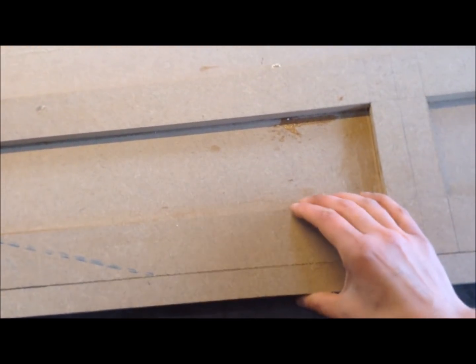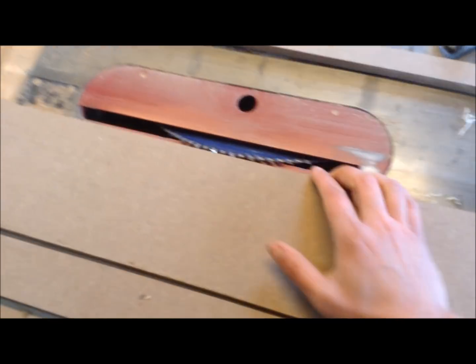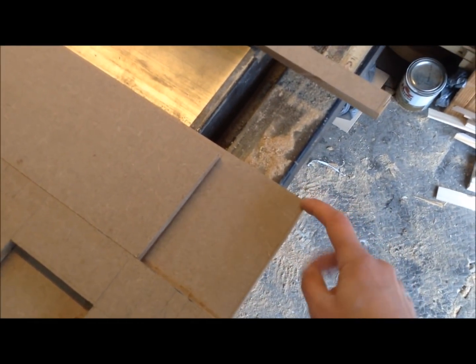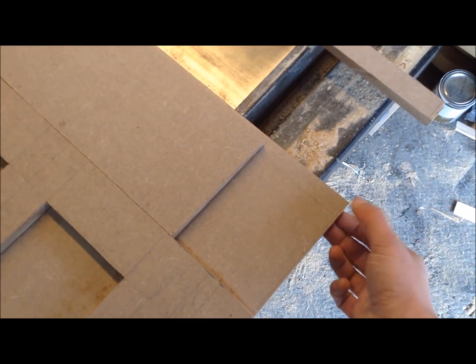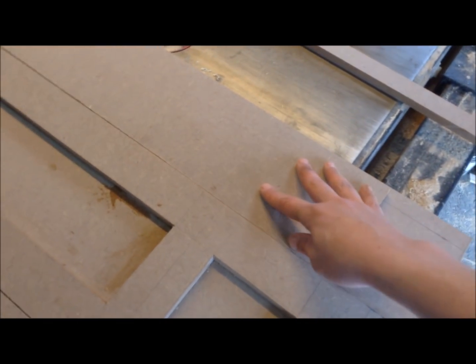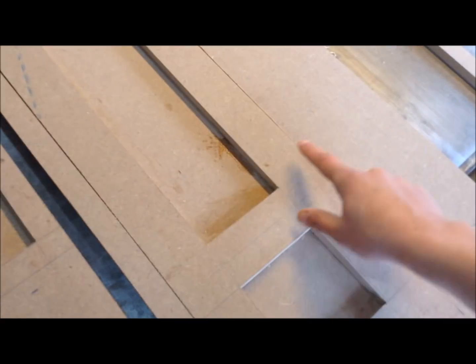So on the bottom there's an inch piece, which I'll put there, and then the leftover scrap I had from one of the cutoffs I could put at the top. Now this is a little short for the top, but that really won't matter because like I said, up here all the way around you're going to have the top of the mantle, which will cover if there's a little gap in the corner. So I could glue these on there and attach them with brads because there'll be crown molding eventually covering this, and there's going to be 1-inch molding at the top and the bottom of this detail piece which will cover these. So if you put hardware into it, you won't have to worry about patching it.